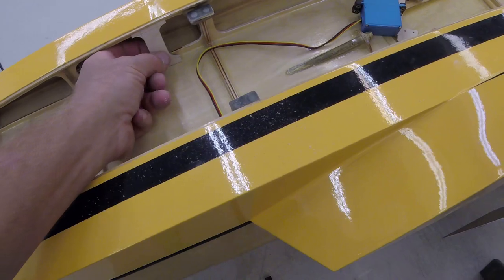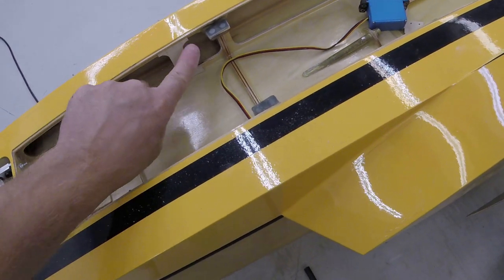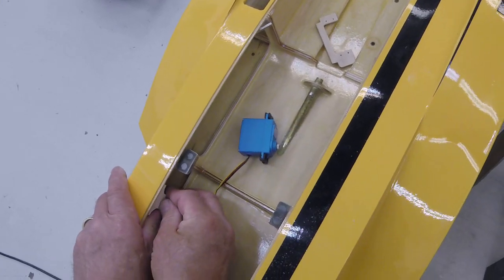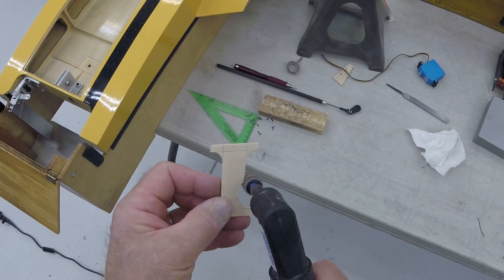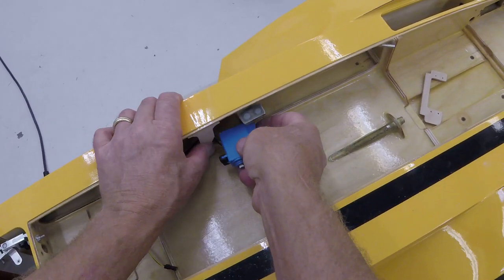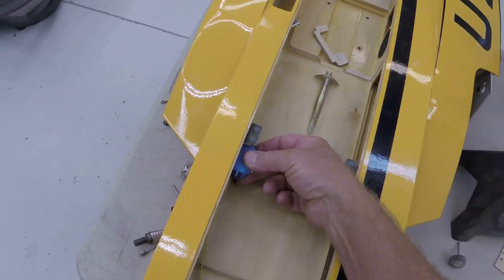So close. Look at that, would you? It's not as pretty as I'd like up here — I might lay that over some more. Remember that part where I said it needed to be wider here for the servo to fit in? Yeah, I forgot that part. So we'll add that in here. That's kind of the way that would look. Let's see if it works. Theoretically this slides in easily, and it does, and it goes up into place, and it does. Now you say it's crooked — I realize that. I'm going to add another piece of one-eighth inch material right there so that the servo will stand out parallel.